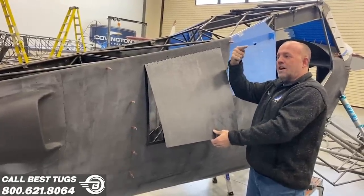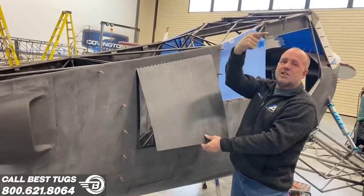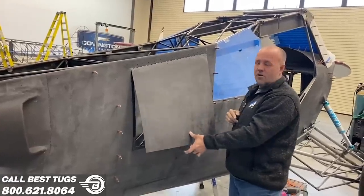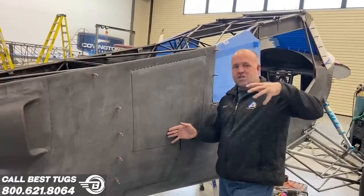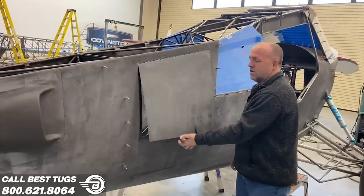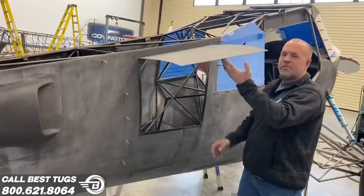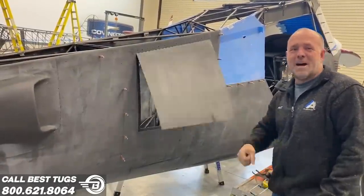That will use the same strut that's getting pushed one way at this transition. It's gonna neutralize. The hinge fulcrum's gonna move to the top, and then the strut will move back outward, constant pressure, and suck the door out of my hand and pull it to the plane, actually putting pressure over center, putting the door into the plane. Pull it to here, it'll have force, neutral, and then let go, and it will open itself. So that's the start, or almost finished, of my new door. Back to you.